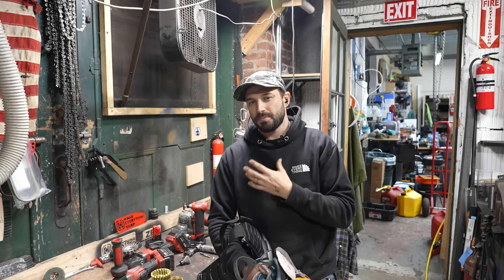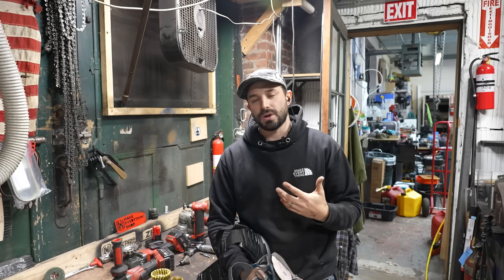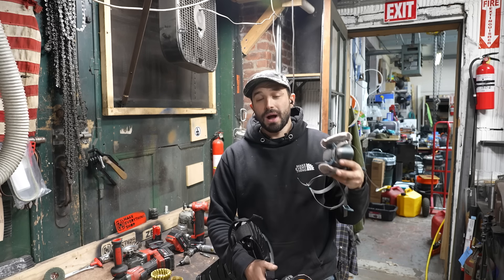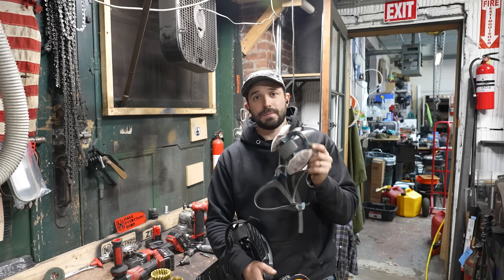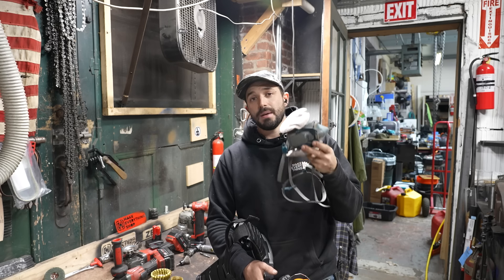The last thing you want is one of those wires in your eye, so you always want to have safety glasses, but even better when using a wire wheel is to wear a face shield. The other thing is whatever you're displacing — rust, paint, mill scale — you're putting that out into the air. From my 10 Tools Under $30 video, you know the first thing I talked about was respirators. At the very least wear a dust mask and be in a well-ventilated area.